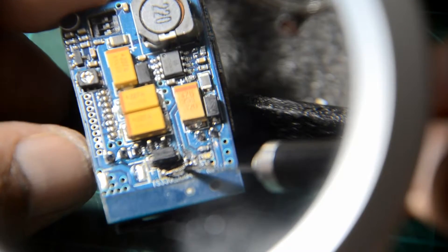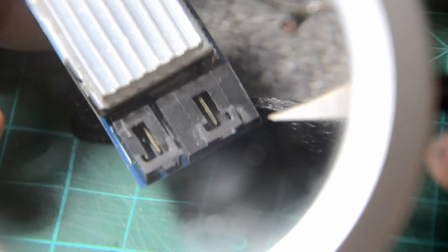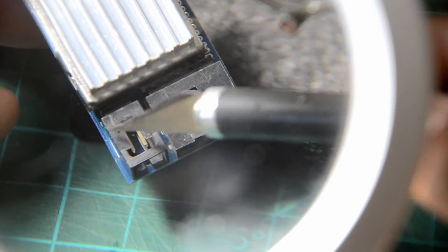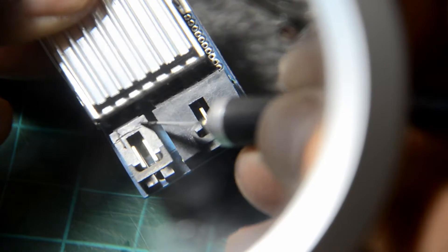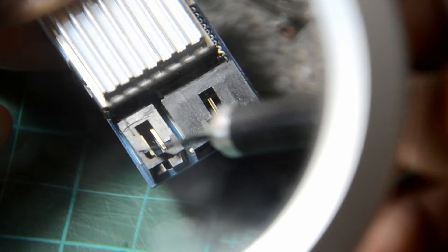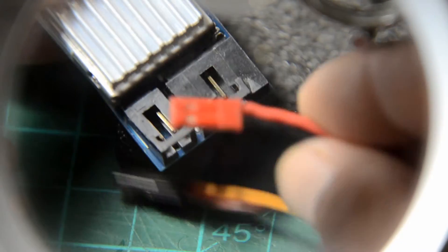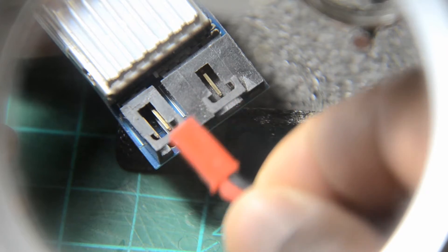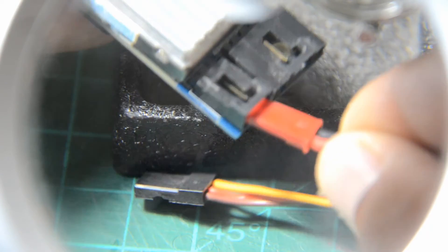Keep in mind: if you do this modification and fix, you won't have a second chance of connecting this improperly. So make sure you mark the connection — this is your minus here. Better yet, take a red paint or red nail polish and paint this red, so you'll never go wrong. Make sure before you connect, you think twice, you look twice. Have your red lead on the plus side, mark it red for plus and minus for negative, and connect it properly.